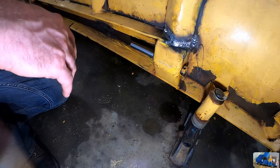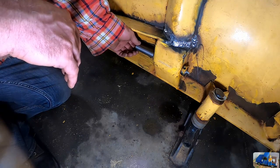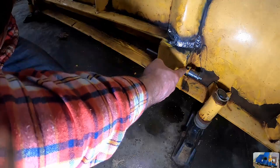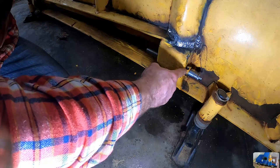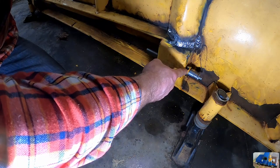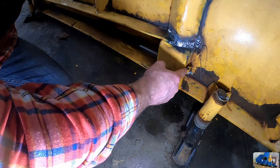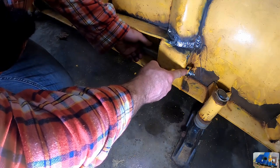So no real excuse why I didn't lubricate it, but I just didn't know there was a grease fitting on there. So I changed it and I made it such that this shaft has an undercut portion. This part I'm not overly fond of, just because of the space that I had available. I took the hole that was already there and I tapped it. Turns out 5/16-18 works. And then I turned a groove on the pin. So I'm going to put a 5/16-18 bolt there to keep it from falling out.